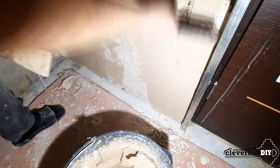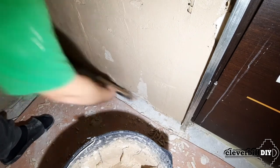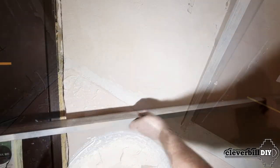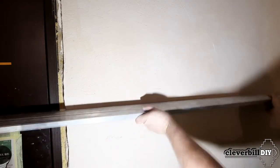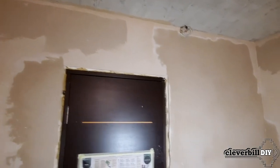Having removed the beacons, I fill the empty grooves with plaster mixture. After drying, the plaster can shrink, so you should always check the walls using the rule. Rubbing the aluminum rule with a sharp edge against the wall, you can see by the characteristic traces of aluminum where the rule fits tightly and where it does not. All corners and sections at window and door openings are checked, and if necessary plaster is added in those places. The task of plastering is maximum leveling — if there are irregularities somewhere, it is better not to leave them for putty but to finish them with a plaster mixture.